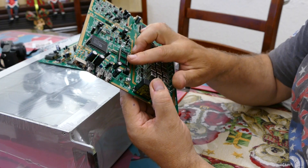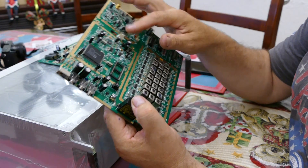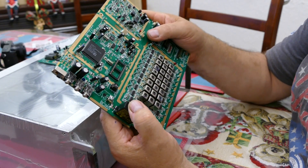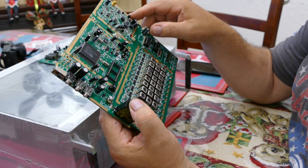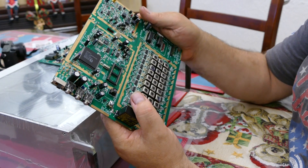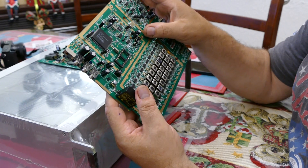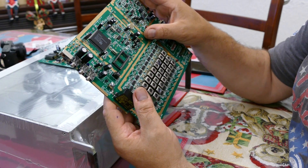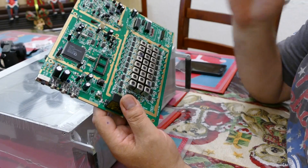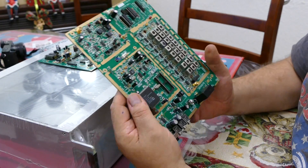There's an EPROM that goes in here which actually sends instructions to the DSP unit. There's a mixer circuit here — this particular mixer is called a Magic Roundabout mixer. It's quite a comprehensive mixer with three transformers, lots of JFETs and other bits and pieces. The main thing about this mixer is that it does a very, very good job on HF, so we end up with a very good receiver. It's basically a high-performance mixer.